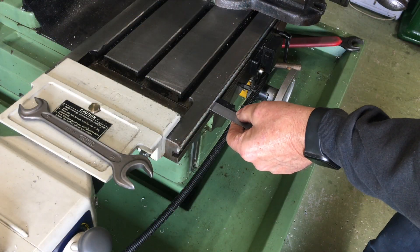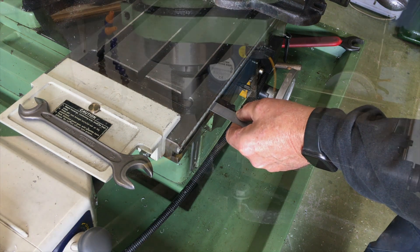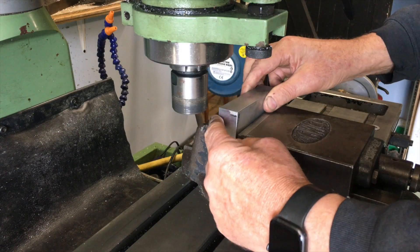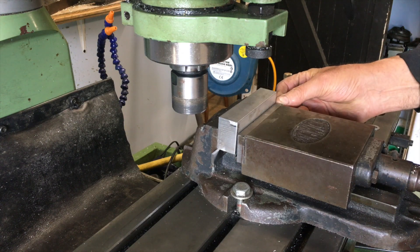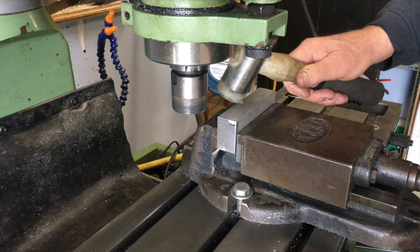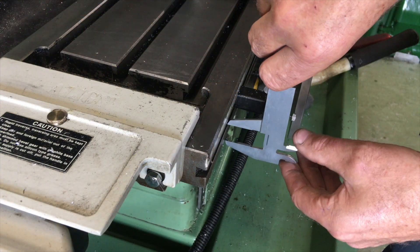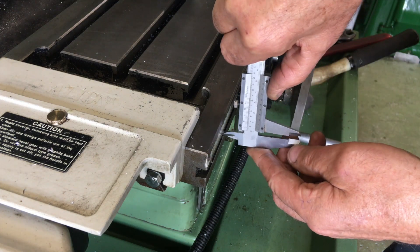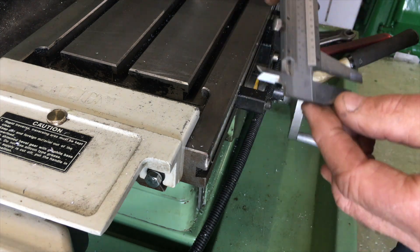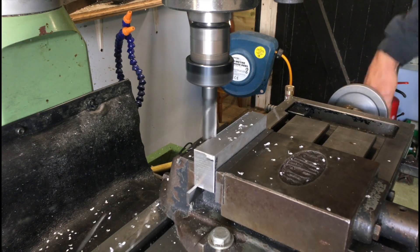I figured I needed 35 millimetres for the standoff and a couple more for the key. These two blocks are of similar size so I don't need to spend too much time dressing them up — none in fact. All I've really got to do is machine to depth both sides of the keyway and then finish off by reducing the central keyway down to two millimetres high. The first cutout needs to be 13.5 millimetres and so long as the remaining key is nine millimetres wide, that'll do.